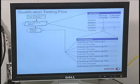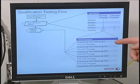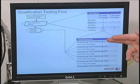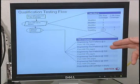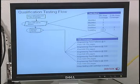Let me give you an example. For an OEM cartridge with a stated yield of 10,000 pages, our test procedure is to run the image test patterns right at time 0 when the cartridge is brand new. We'll then print 100 of the 5% pages, and Christian, if you remember, we used that ISO document that I showed you in part 1. Yes, yes. We'll then, after the 100 pages, print another set of those engineering test patterns. The same ones you just showed us.